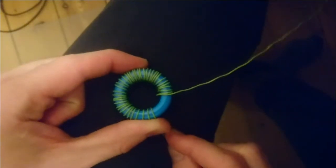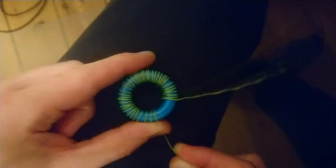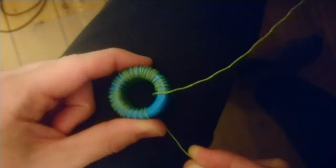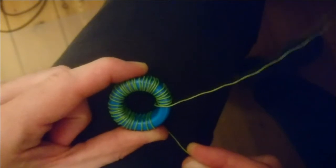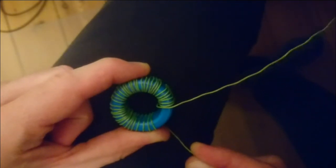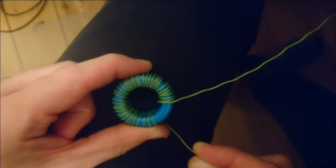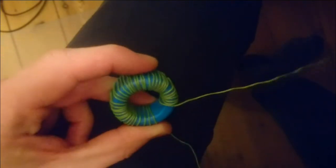This is a 1 to 50 turn ratio current transformer for a QCW Tesla coil, where I need a little more feedback than from the regular cascaded 1 to 33 to 33 on two ring cores for a 1 to 1000 ratio. But more on this Tesla coil later.